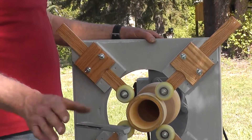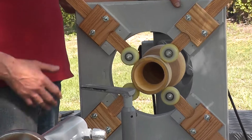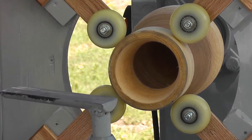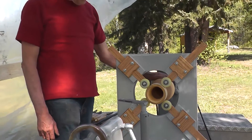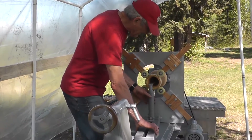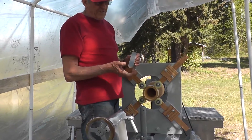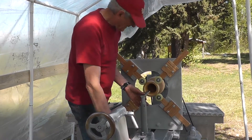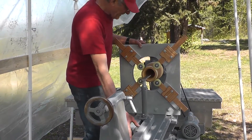These of course were just skateboard wheels that somebody didn't want — they replaced them with better ones — and they seem to work just fine. I don't have hollowing tools as of yet, so I made a little tool rest that would slide right into the thing. That was just made with a piece of half-inch round scrap and a little pin — cut it off, put it in — and I was actually able to hollow the thing out with that.